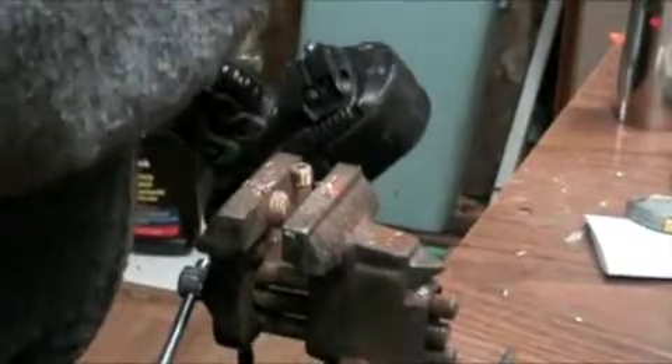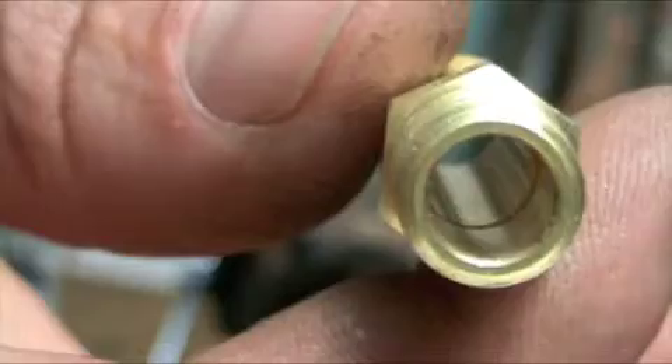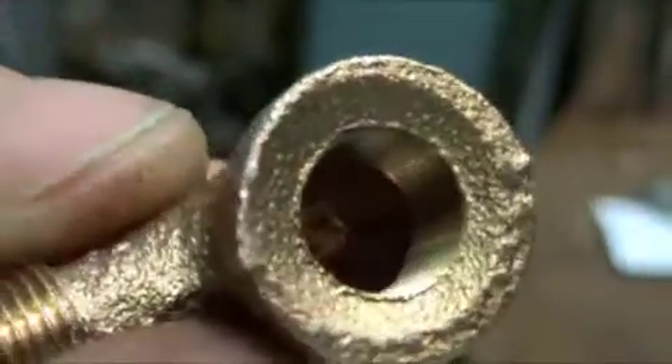The other thing this is doing is smoothing out the actual bore a little bit. Because this is cast brass, the inside of these are fairly rough. We're trying to just get more out of what is really a plumbing product that I'm modifying to do this job. You can see that the barbed ones are perfectly smooth on the inside, and that's what this has done for this as well — it's smoothed it out.